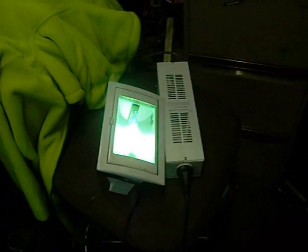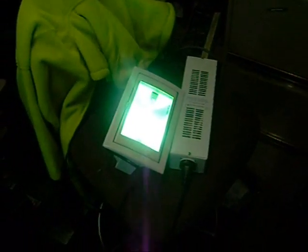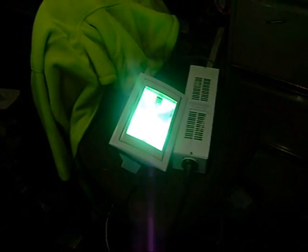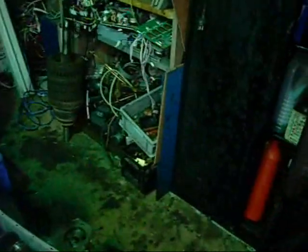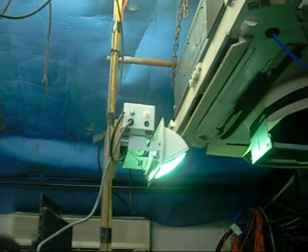Bloody bright — neat little lamps these are. I've got some much bigger ones that I've been meaning to try out for a while — I've got them from Brad. I'll have to find a transformer that works with them. It's coming out nice blue now while it's warming up, and it should come to a pure white by the end. Its starting current is about 1.23 amps and running current is about half of that at the most. It's a nice economical little unit.